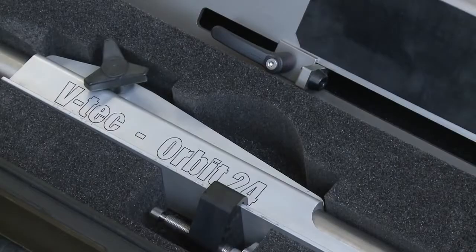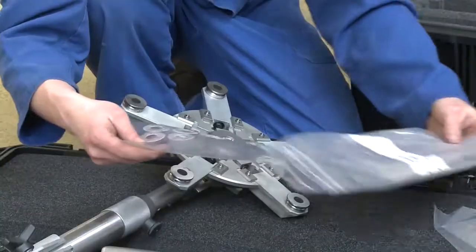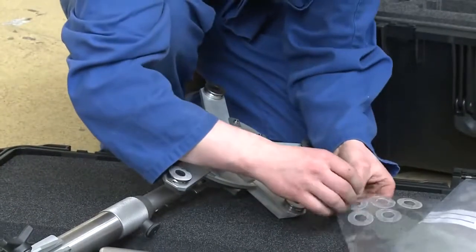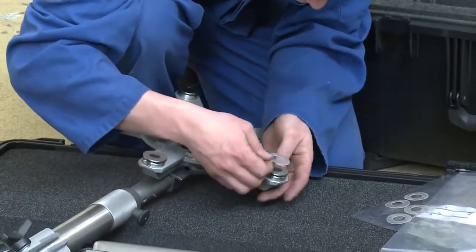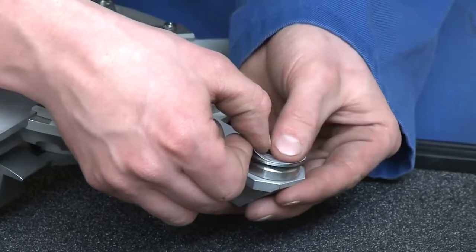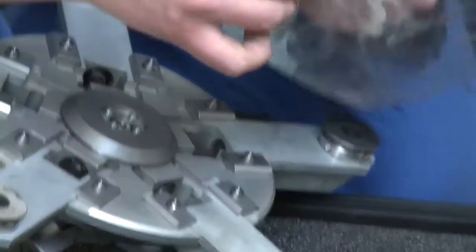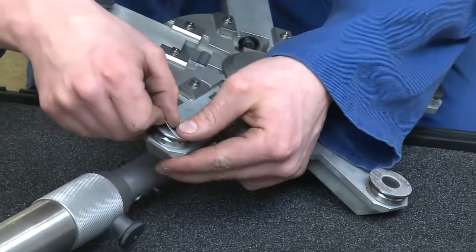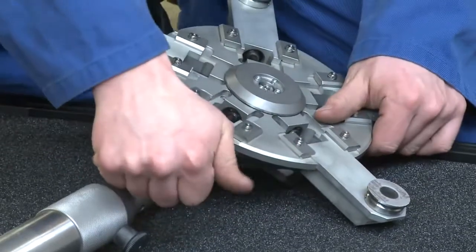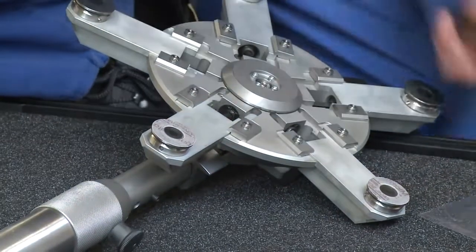The Orbit is delivered with an extended range and quantity of grinding and lapping foil rings. The self-adhesive polyester based aluminum oxide rings are standard delivered in three grains: rough for grinding with a high material removal rate; middle for pre-finishing or removing small scratches and damages; and fine for fine finishing and reaching the required seat tightness. The high quality rings are suitable for all common steel and stainless steel seat materials up to Stellite 4, 6 and 21.